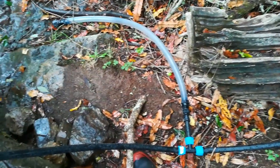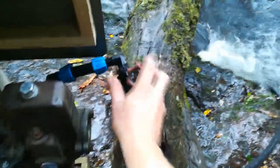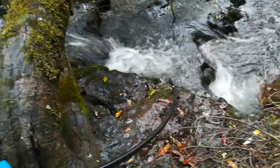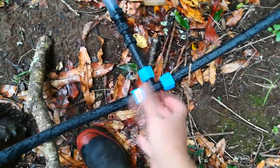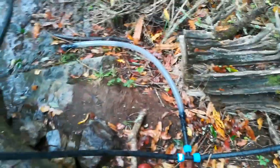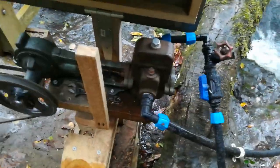This here is my attempt at a sediment trap, because when clearing out the lines you can see a lot of muddy water pour out. The filter on the intake end is just a little stainless steel filter to keep out leaves, but it's obviously pulling up dirty river water and heavy sediment settles at the lowest point of the hose. The idea was to trap that sediment here, but I don't think it's big enough. I probably need to revisit this or build a better filter to protect the rubber washers and plungers inside the pump.